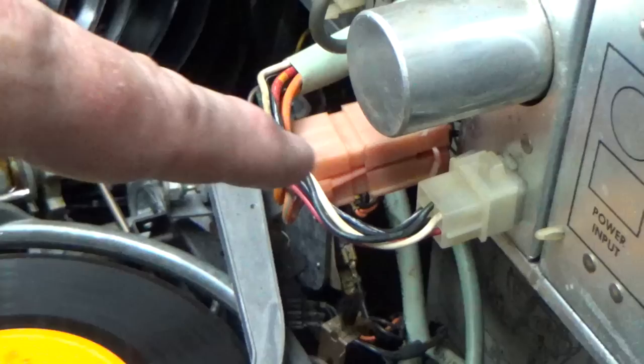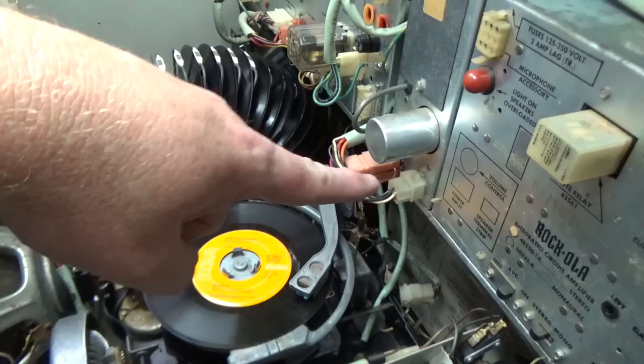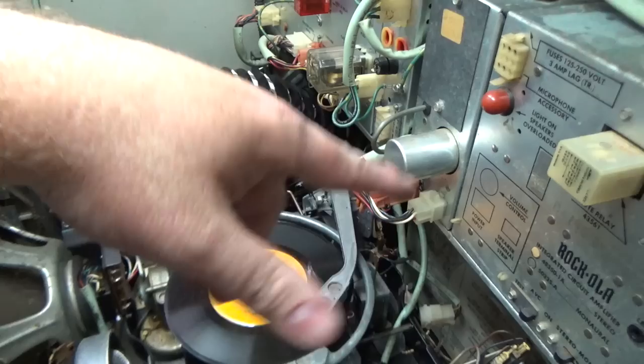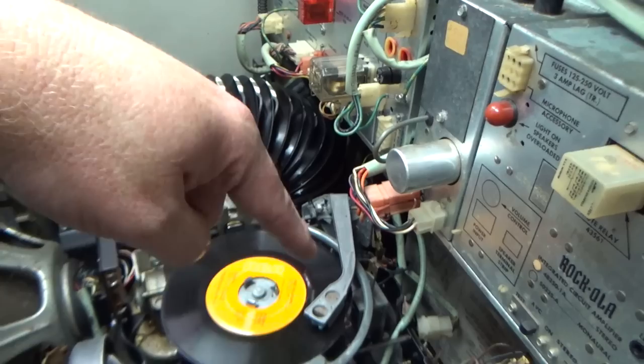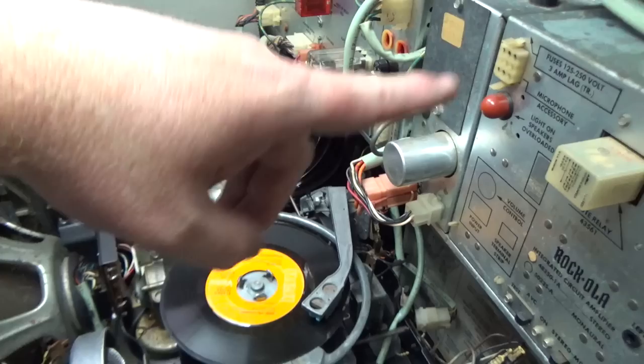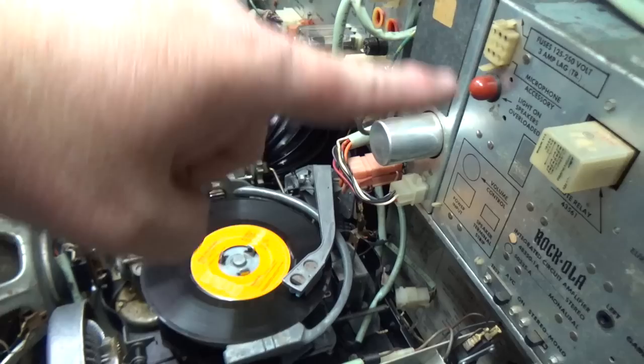If that happens, it will still hang up, because that cancel switch out here controls the power running through all of the switches and everything. But the one on the back won't work, because when you hit it, you're trying to ground a signal that comes out here and it won't connect. You'll also notice that sometimes it won't cancel out here, but it'll cancel if you hit the switch on the back. If it cancels out here but won't with the switch, a lot of times the mute relay won't come on, because that wire is also what turns on the mute relays. So if there's a bad connection here, one switch or the other may or may not work.